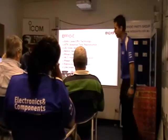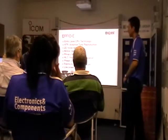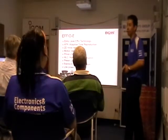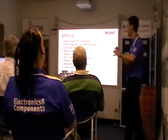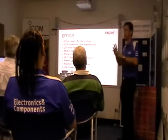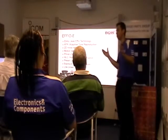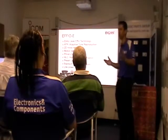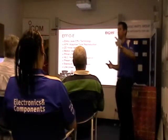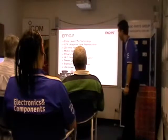But realistically, once you've set it up and you've done your lens and you've done your focus, the rest you would control via your DVR, so your motion detection. In that privacy mask is also like a spotting on the DVR where you can actually remove parts. So if you're doing motion detection and there's a tree moving, for example, in the corner, you can simply spot that out. So every time the tree moves in the wind, it doesn't send your DVR into recording mode.